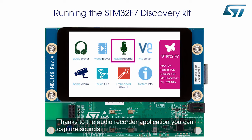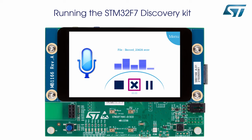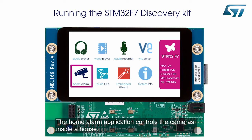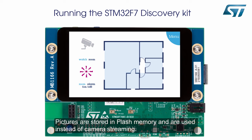Thanks to the audio recorder application, you can capture sounds using the embedded microphone. A VNC server lets you remotely control the STM32F769 kit from a computer using a VNC client. The home alarm application controls the cameras inside a house. Different zones can be activated and monitored independently. No camera is mounted on the 32F769i Discovery board. Pictures are stored in flash memory and are used instead of camera streaming.